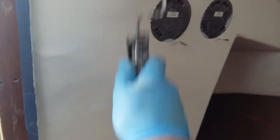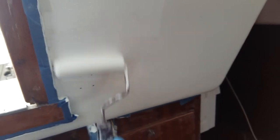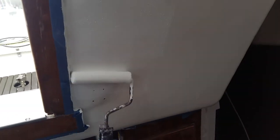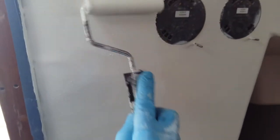So it's just a case of rolling it on — fairly simple. The thing with the paint is that you use a roll and tip method, which is you roll some on and then you tip it off with the brush, and then hopefully it will flow and give you a nice finish.